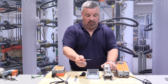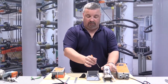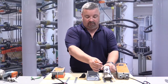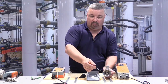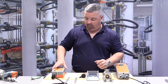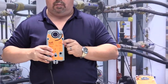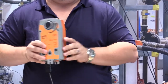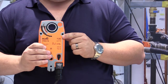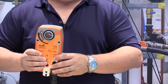As mentioned earlier, I went over the grooves. For normally closed, the grooves are going to be going against the pipe or against the valve — the valve is going to be closed. The fail position is part of the actuator. On the face of the actuator, you'll notice FC and FO, which stands for fail closed and fail open. Whatever side is facing up is the function the actuator will take.